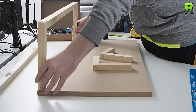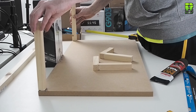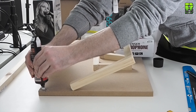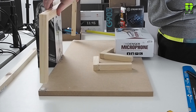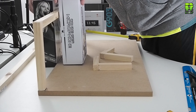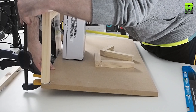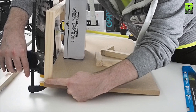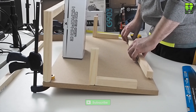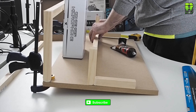Begin gluing the rear goal section. I had to use some boxes because it kept falling over to hold it in place — this was a little bit tricky, so make sure you've got good boxes or clamps available because you'll need to hold this for a good few hours to ensure it's sturdy. I also had to use the clamps to push out the base of the goal support as it was bowing in, to make sure it's flush with the edges of the MDF panel. Then make the smaller goal frame the same way, gluing the 760mm piece in place.